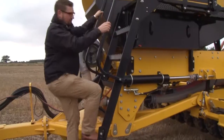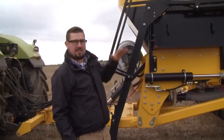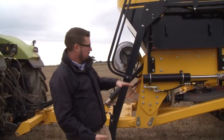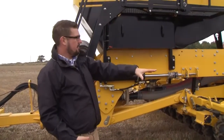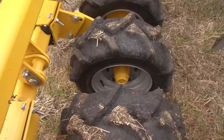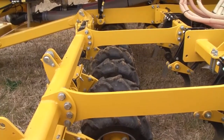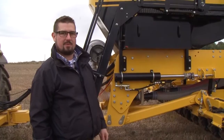One of the main design briefs of this machine was to separate the hopper weight from the seeding chassis, to make sure that as the hopper empties the seed depth doesn't get shallower. To achieve this, the weight of the depth wheels is separated from the transport wheels of the hopper. Every tyre also runs on fresh virgin soil so nothing is capping over a recently planted seed. When finished, the machine folds to under three metres for road transport.